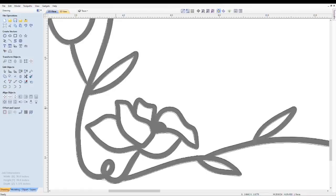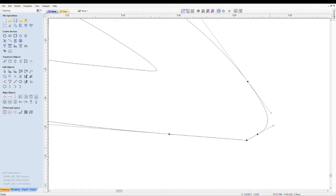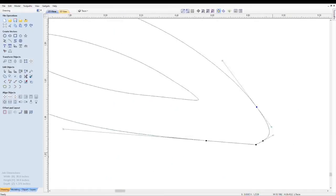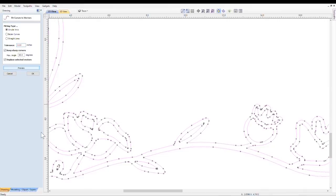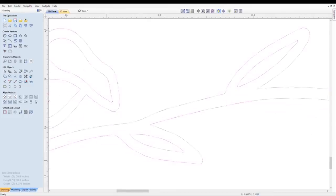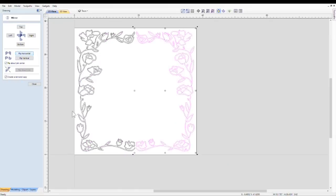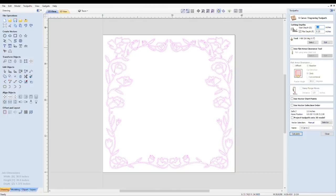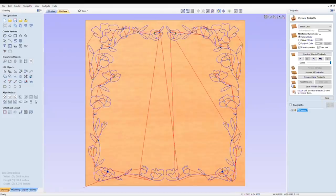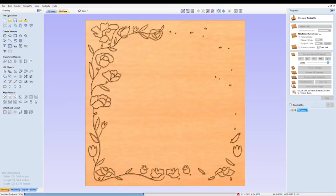I imported the JPEG Kelly sent into Aspire and bitmap traced it, which doesn't always have the best results and can leave some lines jagged as it tries to trace the pixelated image. A tool I've been using recently makes a huge difference — it replaces the rough outline with smooth arcs that blend into each other, and it works perfect for v-carving. Another thing that's improved my results with epoxy inlays is setting my start depth at a 32nd of an inch under the surface of the material, so after the epoxy dries and I'm surfacing it off, I can take off that same amount of wood and it leaves it much cleaner.